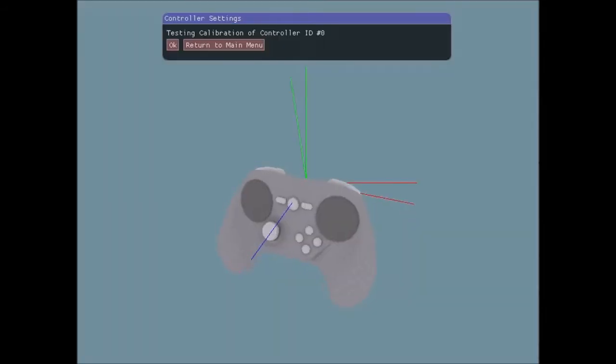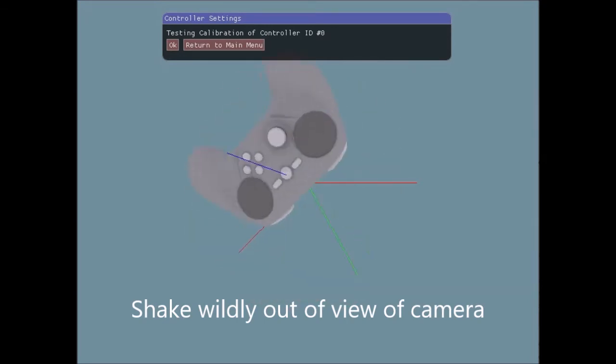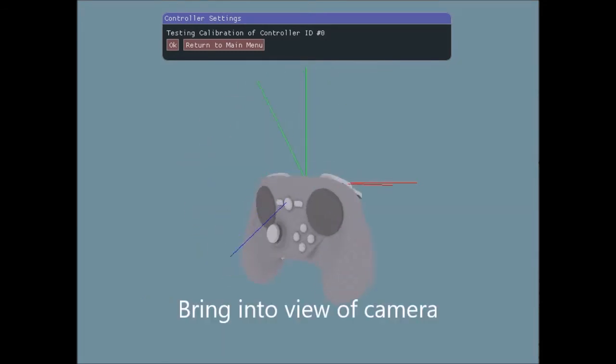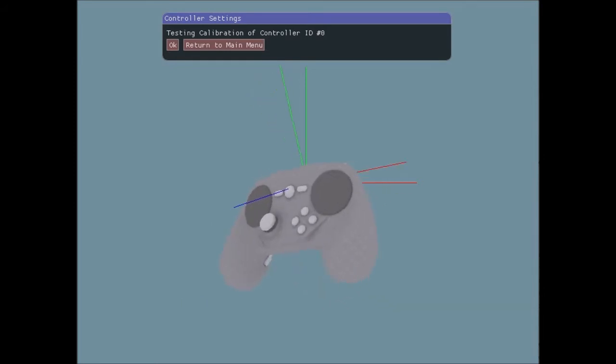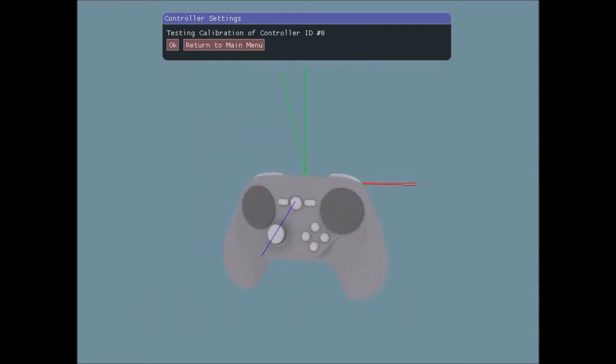At the end of the day, all I really need to do is use this to fight drift in the IMU. Because you remember earlier I said that the DS4 has an accelerometer and a gyroscope. And those two will give you an orientation, but you'll get yaw drift. So basically, anytime I can see the orientation of the controller cleanly, I can blend that against the current orientation that I had from the sensors. And say, hey, the sensors say that I'm pointing off at 30 degrees, but optically I can tell you actually should be facing forward, so I can blend into that and correct it. What that means, though, is that if I go a long time without seeing that sensor bar, then I could potentially get more drift. And so we need to blend against those two factors.